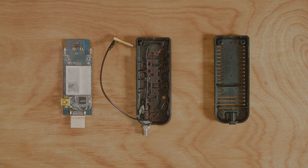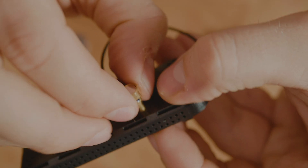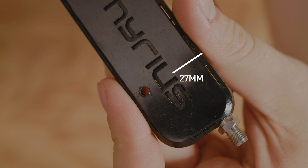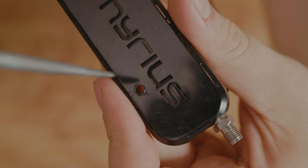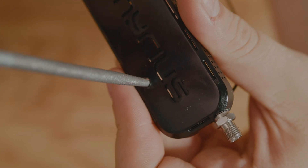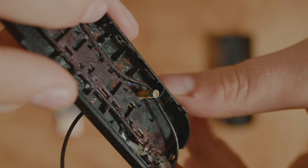If we take a closer look, you can see that all the modifications have really been done to the front case. The first obvious one is the hole in the front case that goes just under the U here. Drill this hole out using a drill bit that's just smaller than the hole needs, then using a file, open that hole up very slowly, making it bigger and checking with the adapter to make sure it's a snug fit.